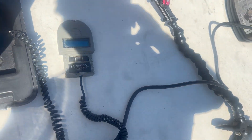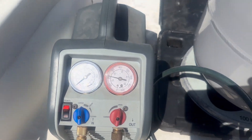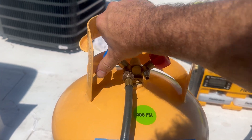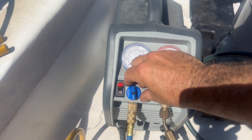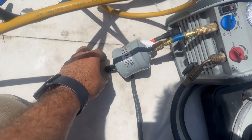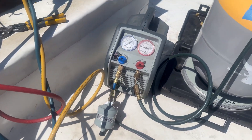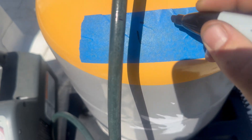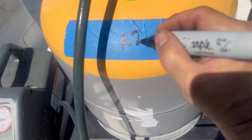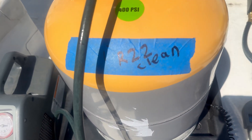I'm now at a little over four pounds of recovered refrigerant and my suction pressure is at zero. I'm going to shut down on my recovery tank valve and turn the machine off. I've got all of the refrigerant out of this system now. I'm going to cap that line dryer and label this recovery tank so it doesn't get mixed up with other refrigerants or dirty refrigerants.